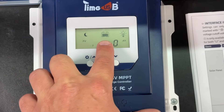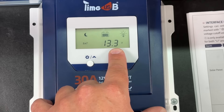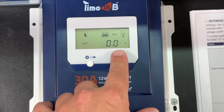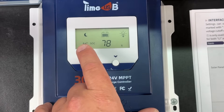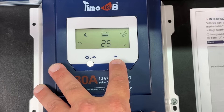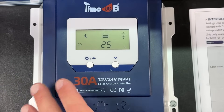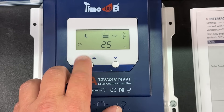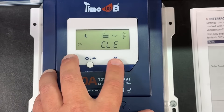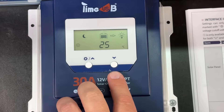There's also a day and night mode — notice the little moon icon, which means it's not seeing any sun. When we connect a solar panel in sunlight, that'll change to a sun. We've got our battery meter where each bar represents 20%, and we can cycle through to see real-time battery voltage, charging current, and battery state of charge in percentage — it's 78% right now, which is probably pretty accurate. Then we have the charge controller temperature, but I can't find a way to change it from Celsius; there's nothing in the manual about it.